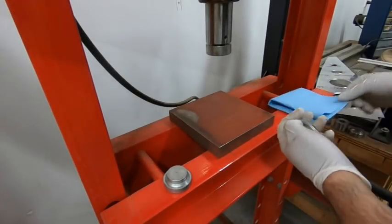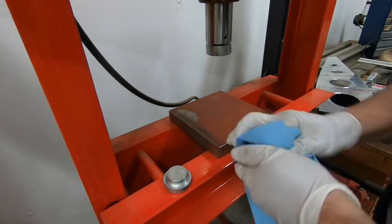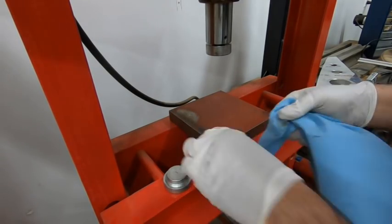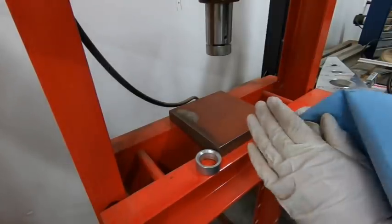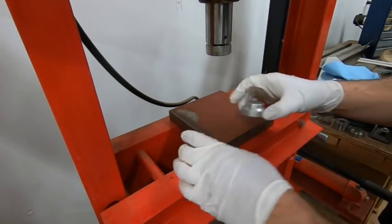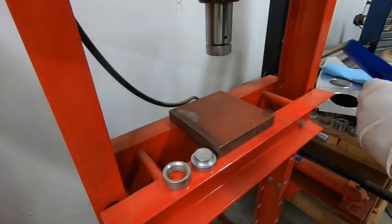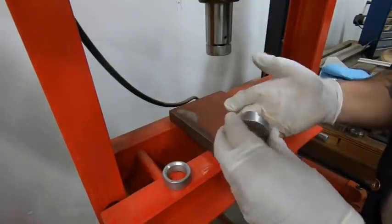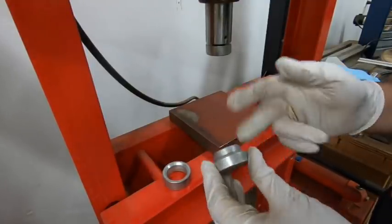This process is finished. What I like to do is first make sure that the dies are completely clean and there's no debris in there, because anything in there will get squished into your nice soft O material and you'll never forgive yourself. Get them all cleaned up, and then you can't put these in dry — I like to use petroleum jelly, fairly liberally. You want the material to be able to move if it wants to. If it binds, you have more chance of getting a crack, so don't hold back too much with it.